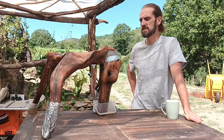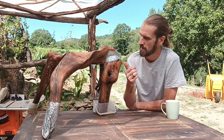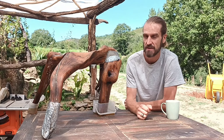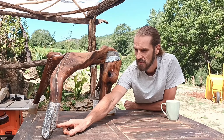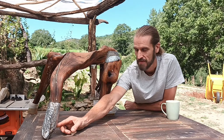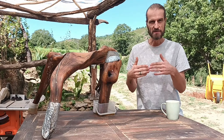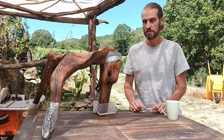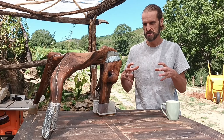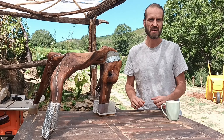This is the first project that's happening. As you can see, it's patched together with a bit of metal and stuff. This leg is completely rotten here. I just kind of backfilled it — I mixed water and wood chips with wood glue, and then as the water swells and the glue dries, it kind of creates this very strong wood filler.